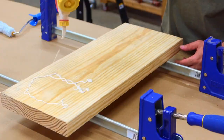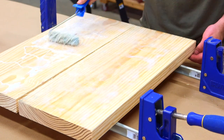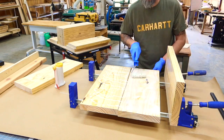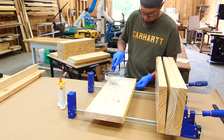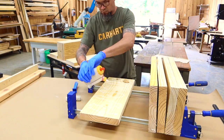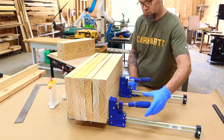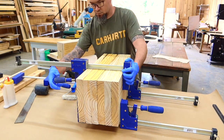Now let's get this block glued up. For gluing up blocks like this, you do not want to scrimp on the wood glue — cover every square inch and reapply. I'd rather have extra glue drip out than not have enough and have this thing come apart while I'm working it. A little mini paint roller works best for this. Once everything has a coat of glue, get it as squared up as possible, then start clamping. Once everything is good and dry, take your block over to the bandsaw.